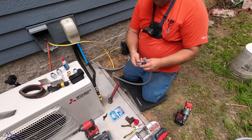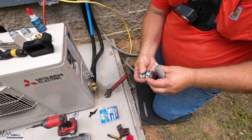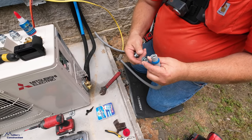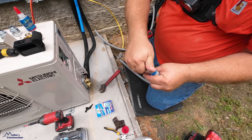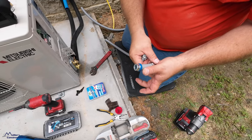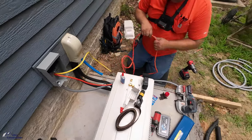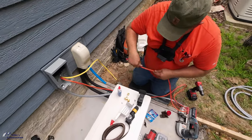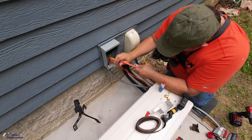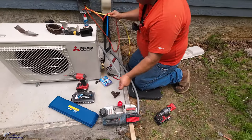So with these fittings, if anybody's interested in knowing, it's a nice metal fitting. When you take this off, you'll have several components. You have the lock collar, you'll have a plastic ring, and then you'll have the insert, which screws into the inside of the conduit. And this presses and goes behind that lip, so it locks in. As this tightens down, it tightens all that together. A nice tight fit. It's a little bit difficult to push through bends and turns. So the straighter and the more taut you hold it, the smoother it slides in. Nice and easy. Oh, look at that.